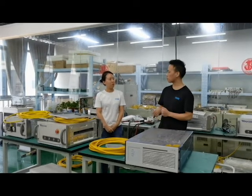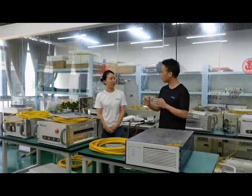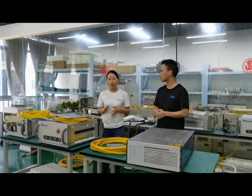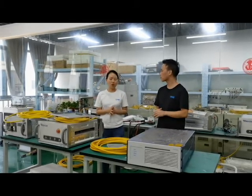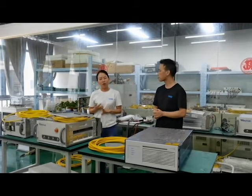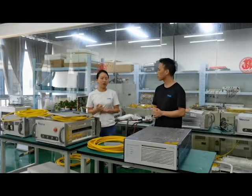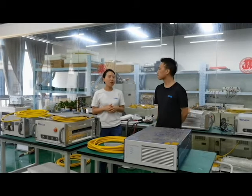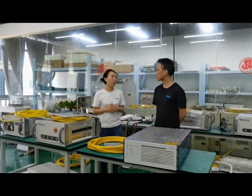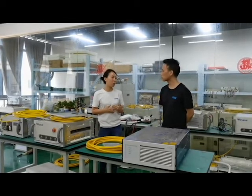Thank you, Jelly. And I have a question — would you like to tell us more about the common laser source faults? For laser sources, as an optical oscillator, the regular problems can be losing power or the power going down, burning the crystal, dirty or burned protective pads, or things like that. You may also have alarms, or the power supply going down. Generally speaking, you are losing power or losing the mode, which causes losing the cut or losing the weld.